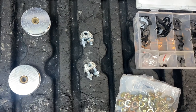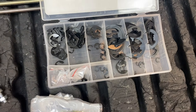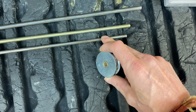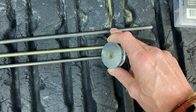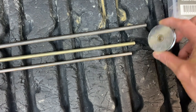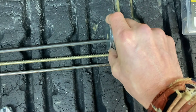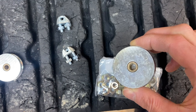A couple cable clamps to secure it to the bed. I've got nuts and e-clips depending on how I build it. The plan is to put the pulley through either bar stock - this is quarter inch and it fits - or this quarter inch threaded rod. This is 5/16ths threaded or just bar. The 5/16ths should fit through there. The end is a little messed up so I'll figure out what I use. I prefer to use the bar if I can. I will use the e-clips to secure the pulley, or if not, a threaded rod with nuts and washers to secure it because I'm lazy today.